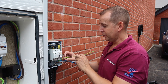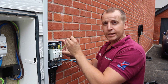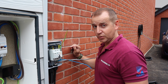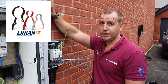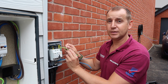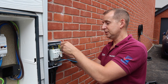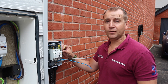I have to be honest with you, this is actually my second visit back here. I came here a couple of days ago but on my way I went to a very popular wholesaler who have a very good online store and they were showing 75 linian clips in stock, and when I got there they didn't have any. So I got part of the installation done and then I spoke to my client and explained I don't have linian clips but I've got cable cleats, and I'd rather not continue with the installation until I had some linian clips. It was slightly inconvenient for the client but I just prefer to do a better job, so now we have them and we can carry on.